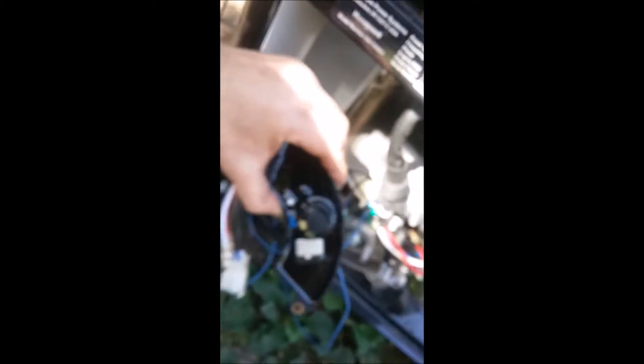I just had a conversation with Generac because I couldn't look up parts for this, and it turns out this is a North Shore Power generator which is not made by Generac — though they later bought them. Going through my box of parts, the regulator looks identical, and as long as I match the voltage on the side we should be fine. I can't guarantee this will work, but I'm plugging it in and seeing what happens.